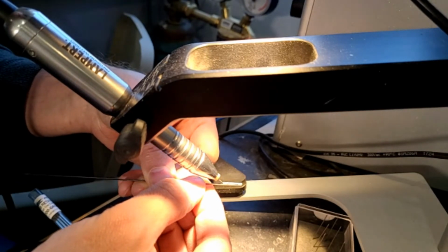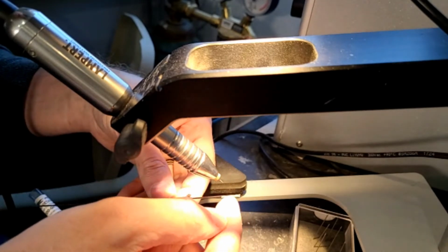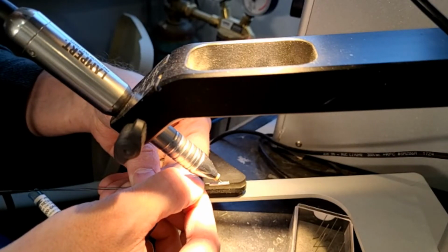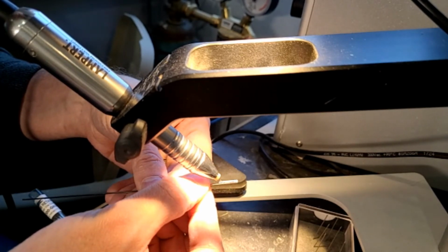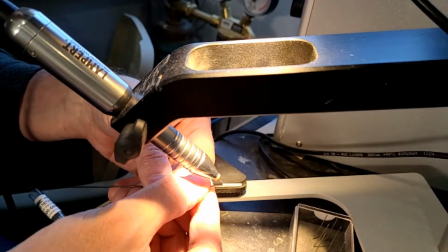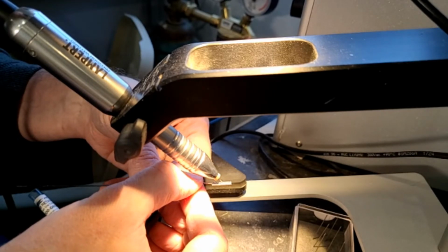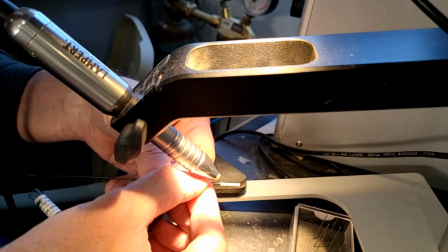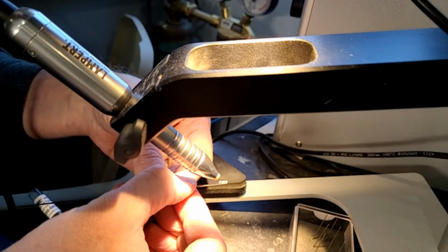because remember this tube has a pretty thin wall, so you don't want to distort it by just welding. Once you weld it, it'll start curling into the weld, so you have to be careful that you spread out your weld a little bit, or else you'll make this beautiful weld, just perfectly in a line going straight down. Stacking dimes, I guess, is what the professionals say. And it will cause the tube to shrink up, and then your 036 wire doesn't fit, and then you got to redo this whole thing. So I'm just flipping it over.